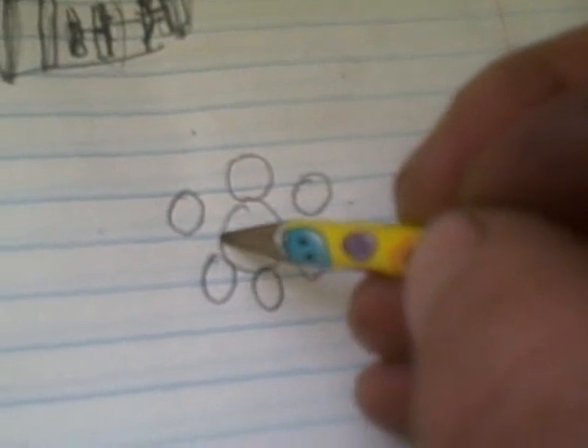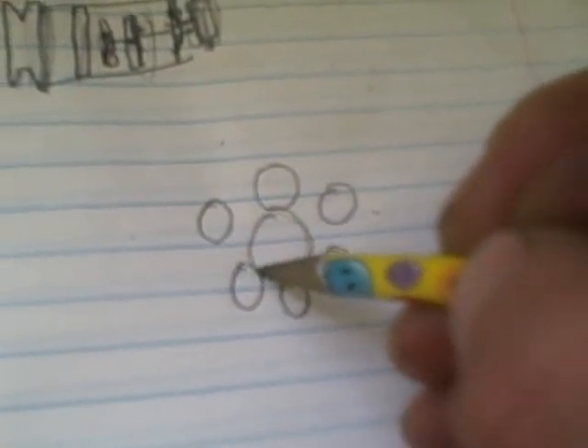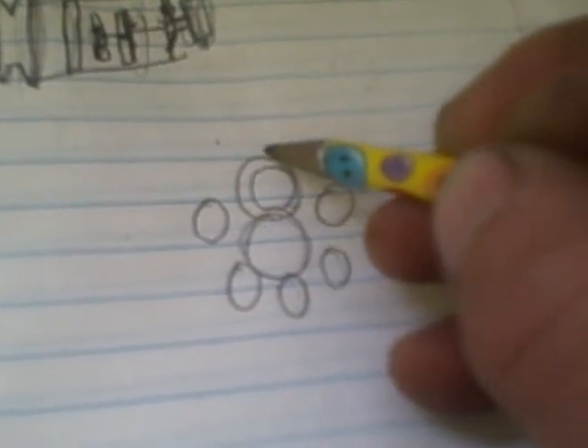You've got a planetary gear that turns this way, so these are all going to turn this way. If you attach your ring — the outer gear here, the orbit gear — that goes around the outside and is geared to these, so then you get this turning back this way. So you've got this going this way, these going that way, and this going this way.